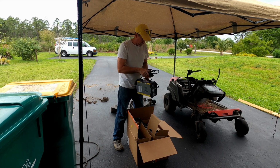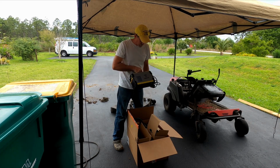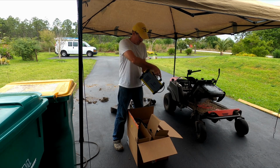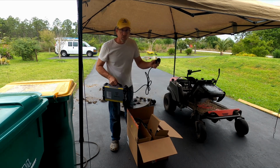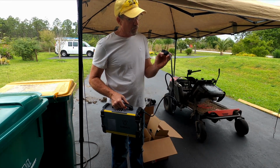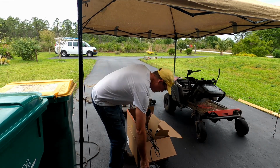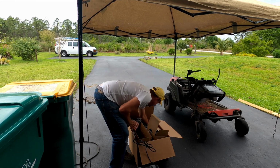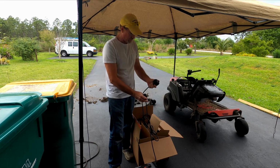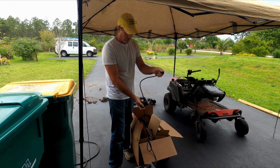Incredible. I have not actually welded anything with it, but I just did some test arcs. Pretty impressive. This one's by Deko, I think is the name of it, and it's an inverter type welder. Comes with a 240 volt plug, but it's only 14 gauge cord, so it does not require a lot of power. And it also comes with the adapter that allows you to run this on 120 volts. You plug that in and there's your 120 volts.